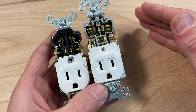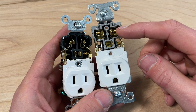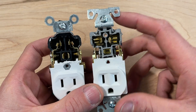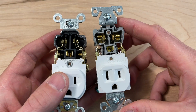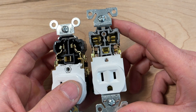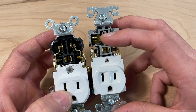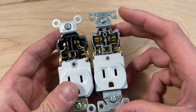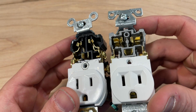One thing to note on the Eaton is it uses the classic contact design typically associated with 20 amp receptacles. Remember, these are both 15 amp, but Eaton appears to share contact design between 15 and 20 amp. That's not bad for a 15 amp, since those contacts had to pass testing for 20 amp as well. The contact gauge is pretty similar between both, and both have nice separation in the housing between the ground prong, neutral, and hot — something you don't always see in lower-end residential receptacles.